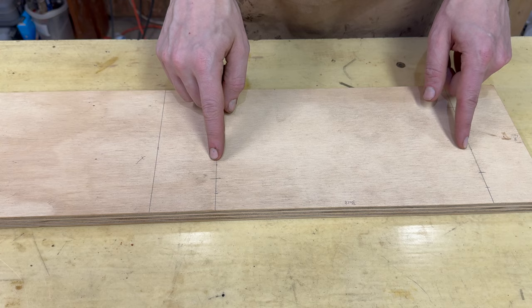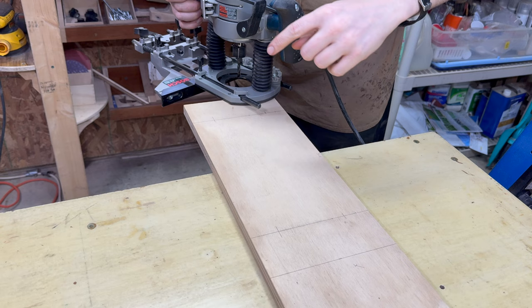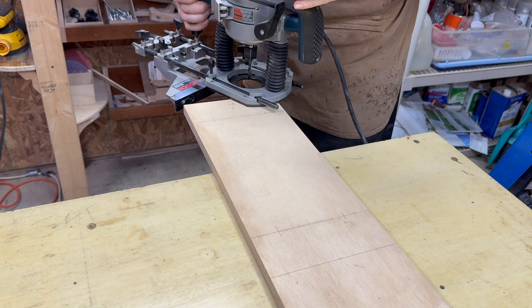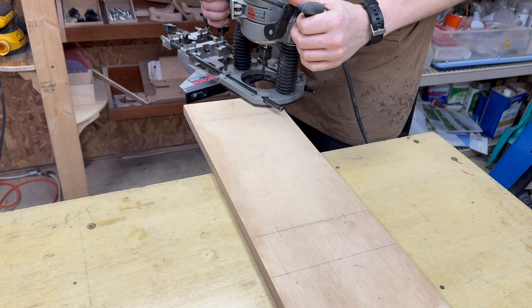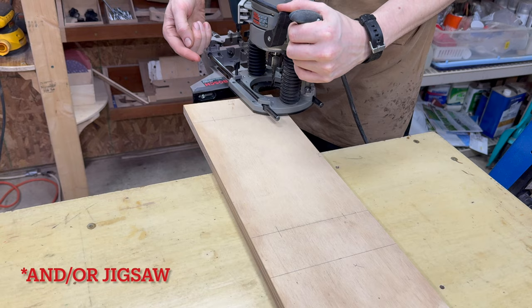I like two and a half inches in on a 16-inch workpiece. We're now going to route out both of these grooves all the way through. I'm going to use a spiral bit. If you don't have a spiral bit and have a straight bit, drill a hole on either end wider than the diameter of your bit and then plunge the straight bit through. You could do this with a scroll saw, but you're going to need a router for the other side anyway.